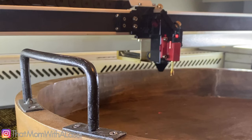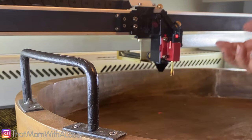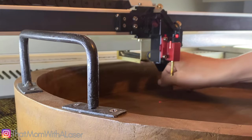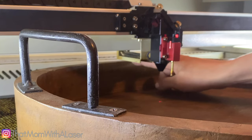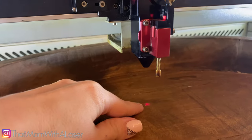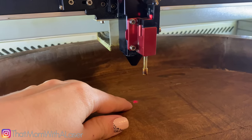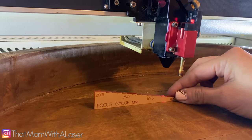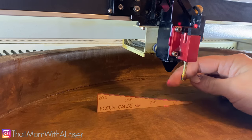I am going to very carefully show you what I mean. As I raise the laser bed, you're going to see how the top of this edge is going to collide with my equipment. If that happens, it's going to be a disaster, and I'm going to be set back hours. So obviously I can't do this. Because I have a tall edge, I can't get my nozzle close enough to the bottom to get into focus so that I get a nice, clean engrave. To engrave this board, I need to be about 8.5 millimeters from the bottom of the tray, which clearly isn't going to happen.